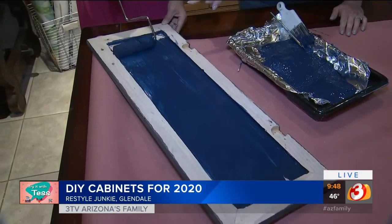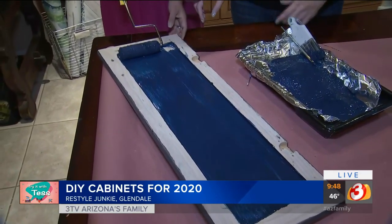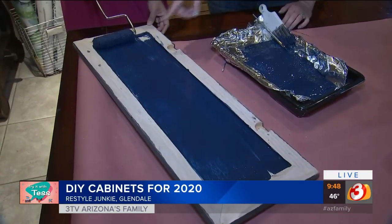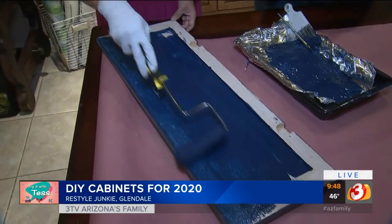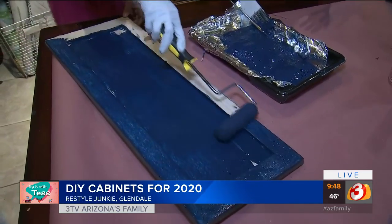Okay, but see, you're pushing it. Oh, don't push. Remember, it's a roller, not a slider. Okay, so light touch and let it roll. And there you go. So let's see you do the sides. Real light touch, and see the difference. It'll roll nicely. I was totally pushing that first time. Right? It's something, I don't know why when we want to paint, we tend to push. You don't need to. Really light touch.